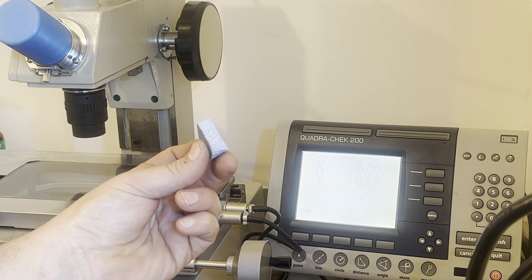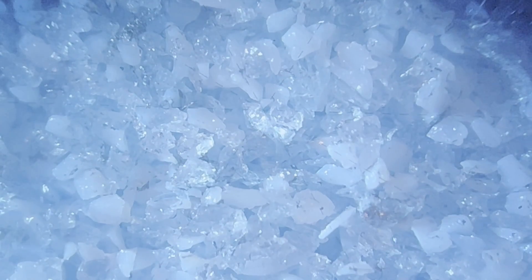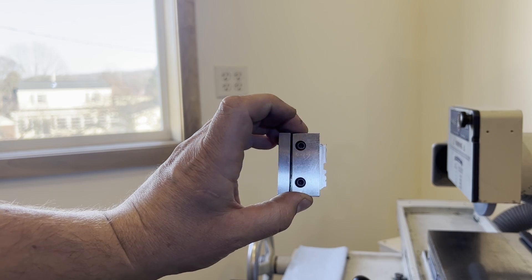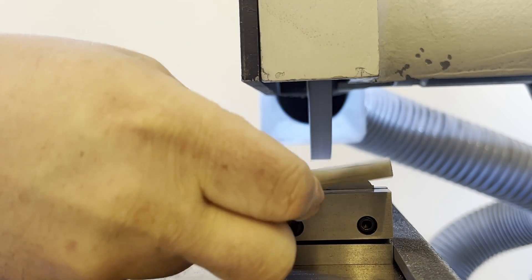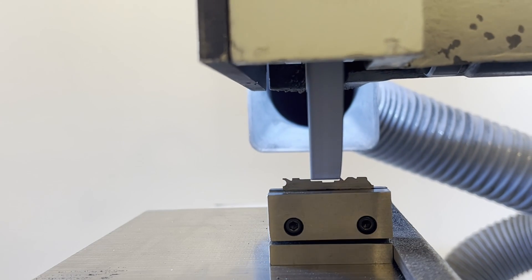Before we get to grinding, I wanted to take a look at the wheel. This is a chunk of a Norton 5SG 60-grit I-bond, and the wheel abrasive grits are not all that consistent — you can see some long shards and irregular shapes. To really truly know what the corner radius of the wheel is, we take a razor blade and plunge into it; once we're all the way to depth we'll deburr both sides and go back through a few more times. That gives us a consistent representation of not only the form of the wheel but the width, and then we can check it on the microscope and probe a few spots on that radius.